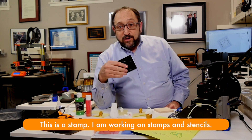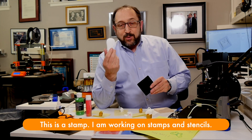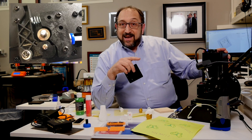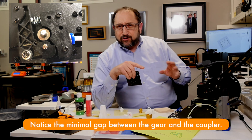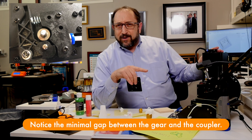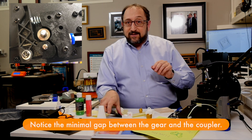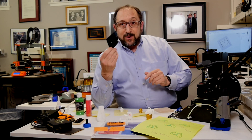I decided I had to use flex filament. The printer I normally print TPU in is my Prusa, but that was busy trying to get the Ruby nozzle working. So I wondered if my Mini Select could print flex TPU. The Mini Select version ones had trouble, version twos were a little better with people modifying the extruder. But my extruder looked different from pictures online — it seems I have a V2 Prime, because my extruder does not have a gap when feeding filament. I printed it at a very high temperature to make extrusion easy, and it printed perfectly.